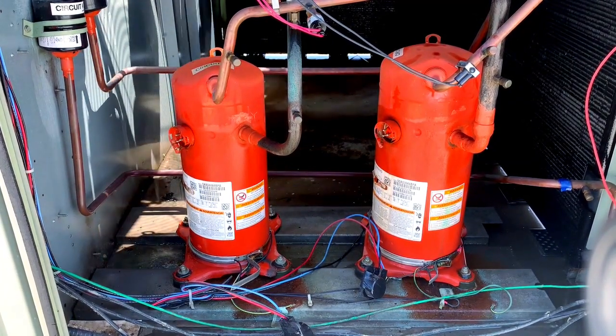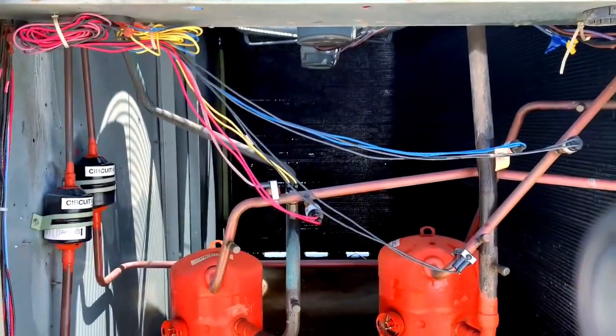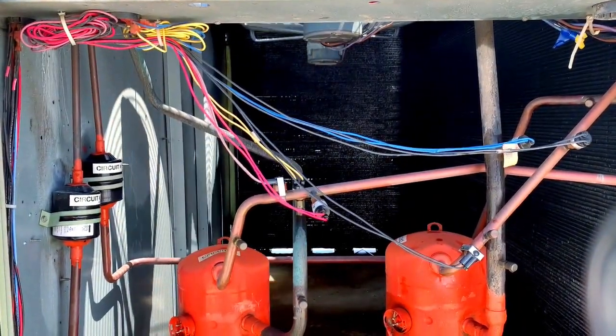The compressor won't turn on yet, but my condenser fans will run and they will dry the coil, because microchannel coils hold a lot of water.